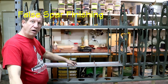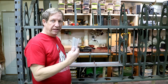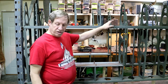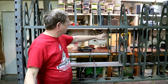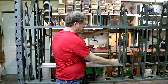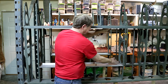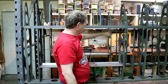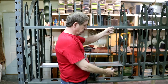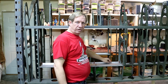I'm working on finishing up the false spar. I need to put the doublers in for the fuel straps, so I made them up and they're all ready to go. I've determined where I'm going to remove rivets up here on the main spar on the top side, so the bottom straps can come around, go down, and go out to the doubler that we're going to set in here and rivet in place. I'll drill these rivets out, put a plumb through the hole, and that will give me the location for the hole on the doubler down below.